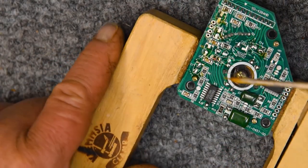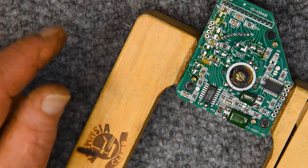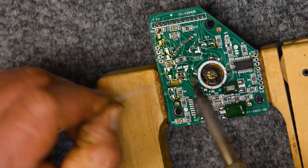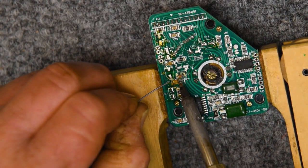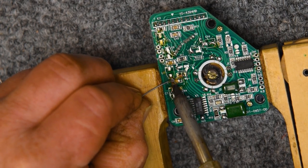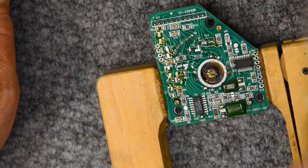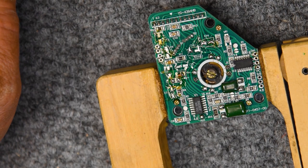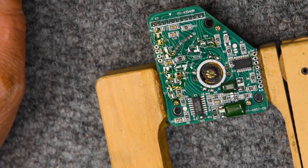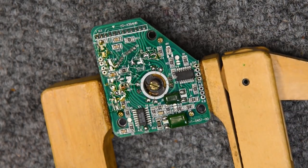And that's fine too. Again, it's just this heating cycle problem that I don't care for. Or not problem, but just having the multiple heating cycles, I try to reduce those as few as possible. And this is not the low melt solder on this. I just use standard solder on those small capacitors like that. But good flux, a good RA flux to cut through the old corrosion.